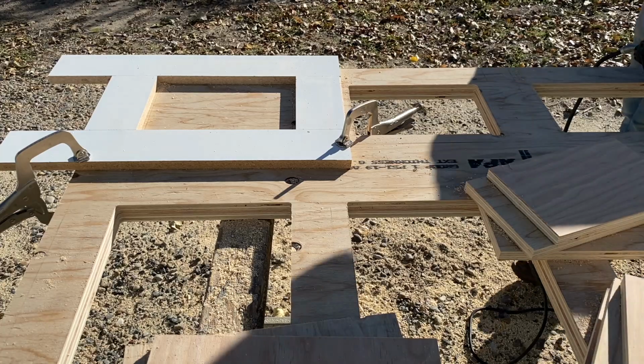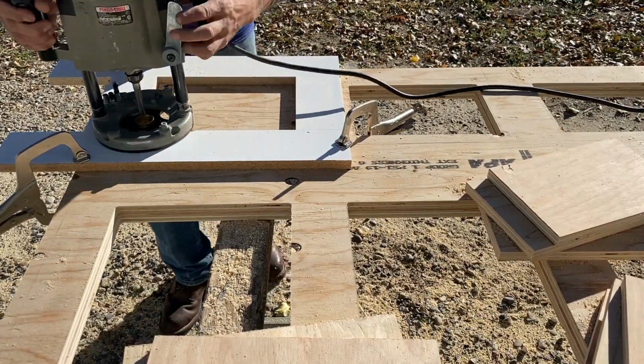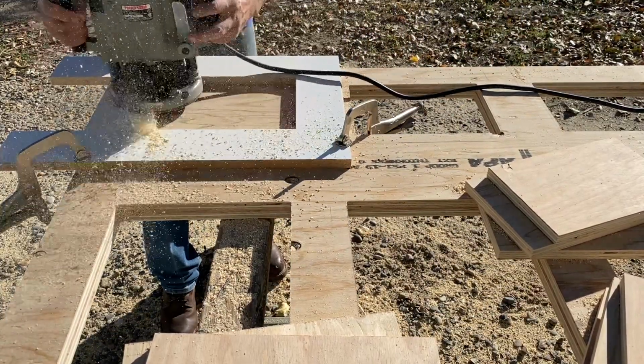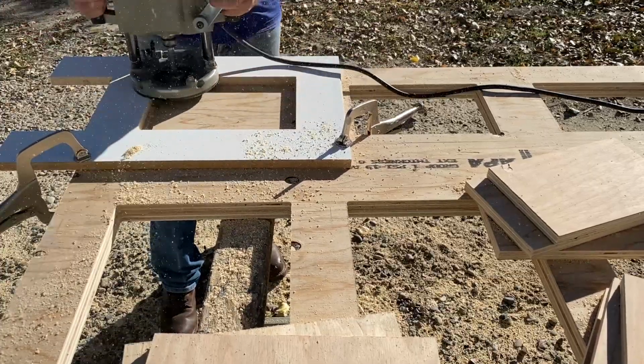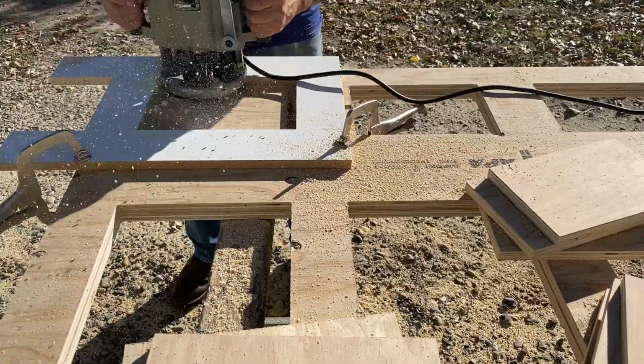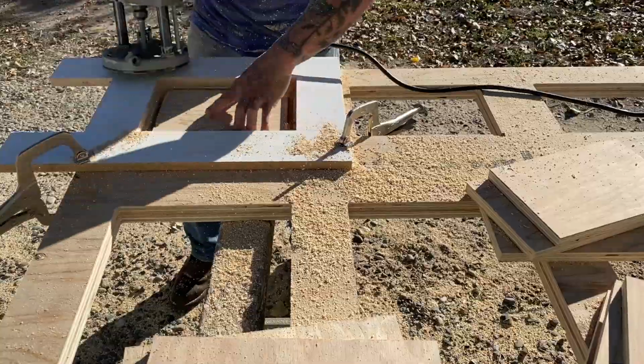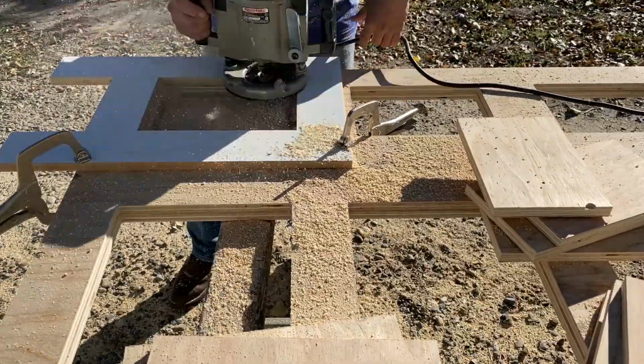Maybe the width is different, but the height is the same. And I can just start with the larger one and reduce it down to the smaller ones using 3 pieces, and then add the 4th piece as I continue to reduce the size. Again, routing outside to reduce the mess and ganging 2 at a time. That just makes sense, yeah.